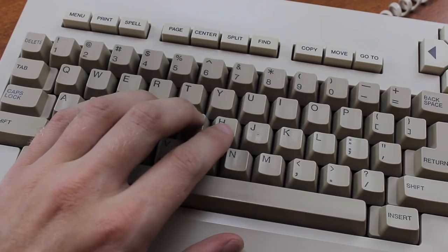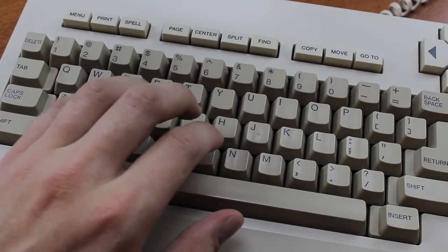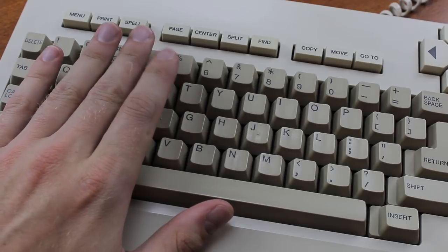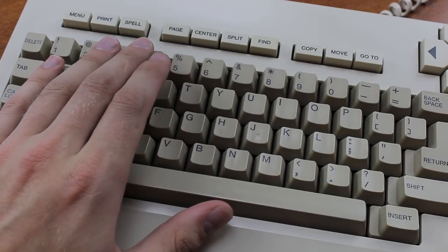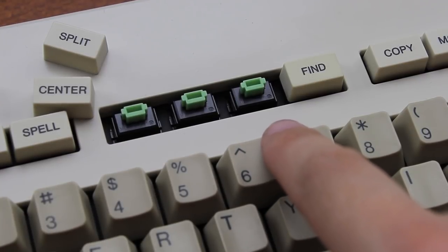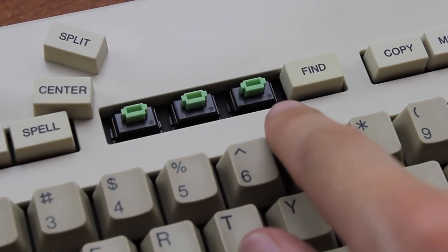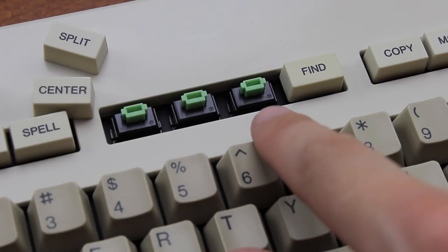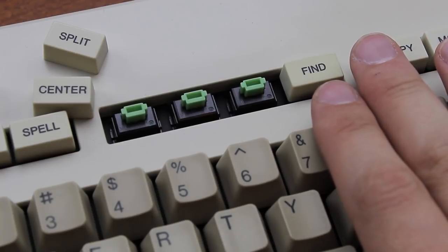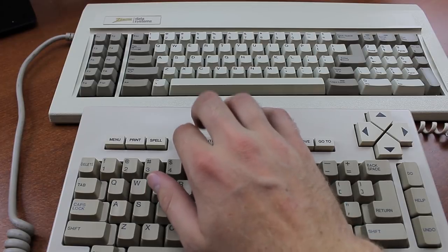And finally there's of course the sound. [typing] Yeah, that's an Alps board alright — why do these things always sound so nice? The SKCL compact switches are very similar to green Alps, i.e. they're very smooth and light linear switches, but they're much less deep as the recess that's normally present has been left out so that they could be smaller in footprint for use with smaller keys. They were especially common on brown Alps keyboards. They do of course sound very different from normal green Alps.